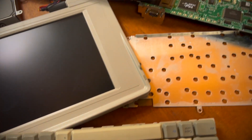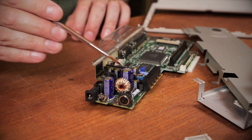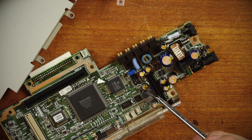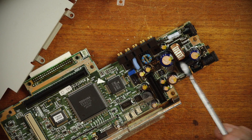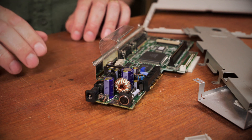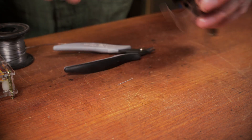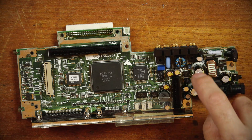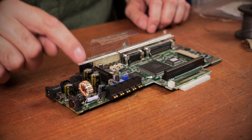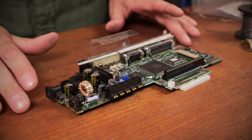I've pretty much needed to dismantle the entire laptop to get to this piece here. I'm going to swap out these larger capacitors here plus these smaller ones next to it. I'm not going to worry about these ones because they're some weird value and my local store didn't have them, so hopefully the issue is with these larger ones. I'll pull them off the board and we'll find out. Let's do a desoldering and soldering montage. And we're done — I've replaced all of these ones here. None of the ones I pulled off tested that far out of spec, so fingers crossed this is actually going to fix it. We'll put it back together just to test and turn it on and see what happens.